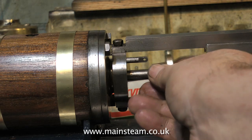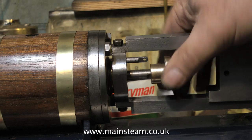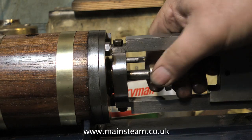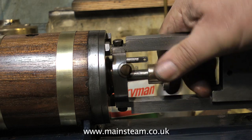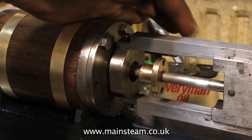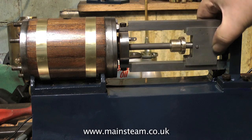It's a little bit like wiring the old rubber-type plugs and then realising you forgot to put the cover on the cable first. What I had to do was tap the pin out, put the gland on the piston rod, and then refit the crosshead. And it turned out to be a good thing really, because I had to turn over the crosshead — it was a better fit altogether, and it's now really smooth end to end on the crosshead bars.